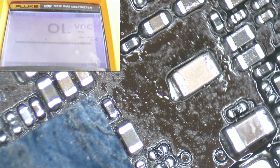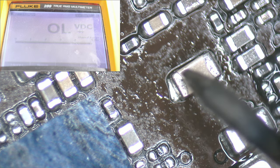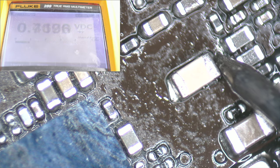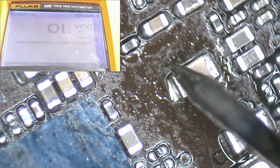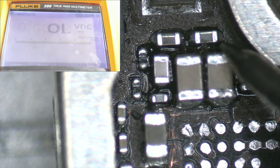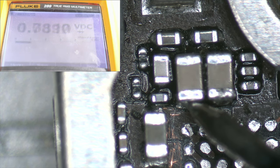We then use a multimeter to verify the component. In a capacitor, one track should give continuity to ground and the other should have a value. We proceed to check the two capacitors that were in short circuit. It seems that the short circuit of the line has been solved with the replacement of the damaged capacitor.